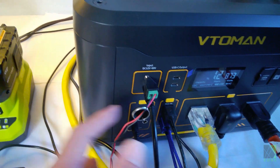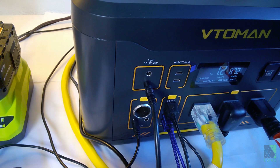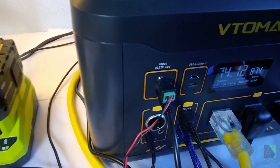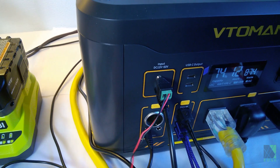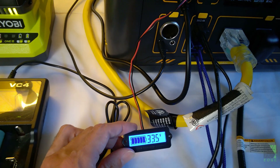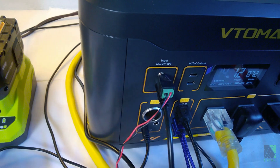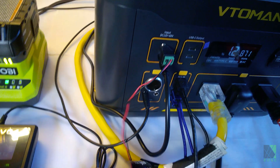The input jacks are a couple of 2.1 millimeter plugs. Normally 2.1 millimeter plugs are not rated for very many amps. I will say these are all metal and they look very strong. However, I wouldn't put more than 10 amps in. Because of the 2.1 millimeter jacks, I recommend you keep your current as low as possible and your voltage high — meaning put your solar panels in series and get the voltage up and the current down. Here I'm running about 30 volts and that's the minimum I would recommend for the input. This does come with a 12-volt car charger, which is why it says 12 volts to 60 volts, but I'm mainly testing the solar aspect.